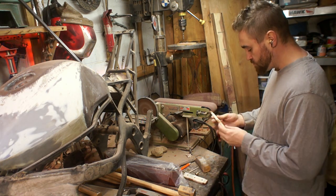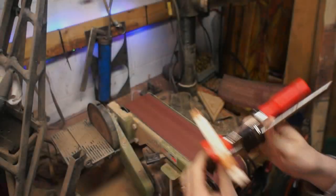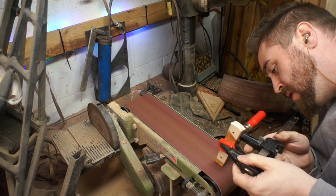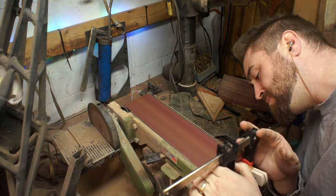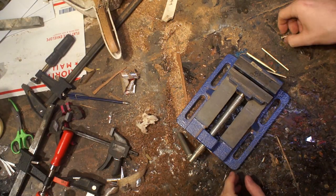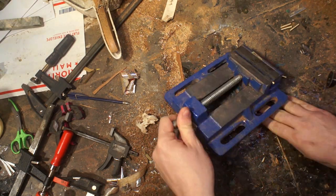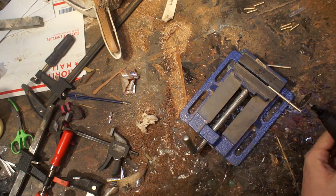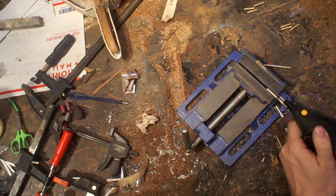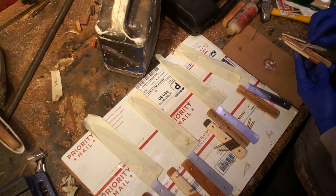At this point I still think I'm getting these scales precisely finished before I glue them on the knife, so I'm going through getting them to the final thickness. No matter how you do it you have to do this top part and get it finished before you glue it down on the knife. I clamped the two pieces together that way they would be exactly the same. Heading back to these pins, I'm using a Dremel to cut them off to size — each pin was a knife's worth, so three pieces. Trim them down, getting ready to stick them in there.